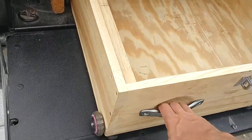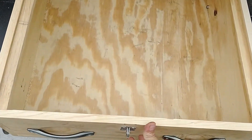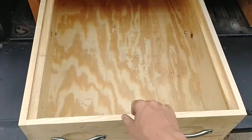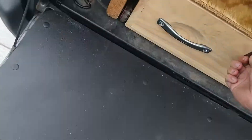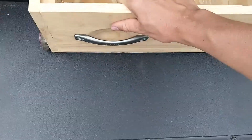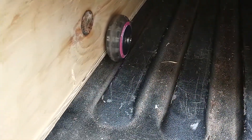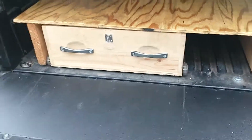The way I did the spacing on these wheels is that this one drops in there and this one just overhangs so that when it's there, it kind of locks into place — it acts like a little detent to want to settle right there. That's useful when we use this as a table, so a pot of coffee won't roll away. It's not rolling super easy right now, and I'm probably going to shave a little bit off here just to ease it going in and out. It doesn't have any real lateral movement, but that'll help guide it into place. Our spacing worked out absolutely perfect using the bed rails as a guide, and I'm pretty happy with it.